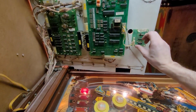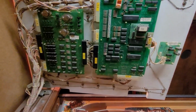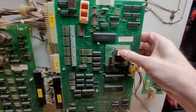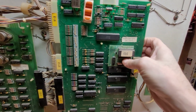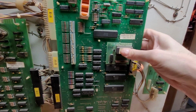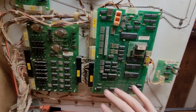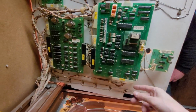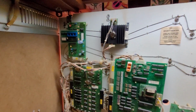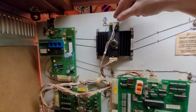So most people disable these, from my understanding. But you know what? I wonder if I push on the daughter board. This is usually the issue. I wonder if I can get anything to happen. These solder joints get cracked over time. So I could also reseat a whole bunch of connectors, just not with the power on. But this is pretty much what I expected. I might have to rebuild the power supply, check voltages on that.